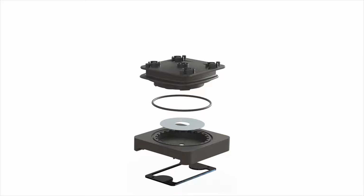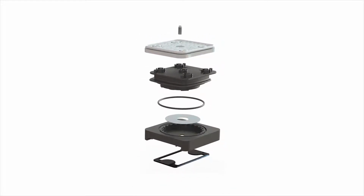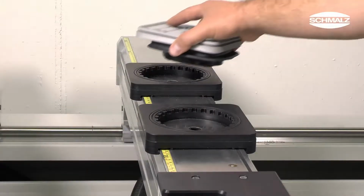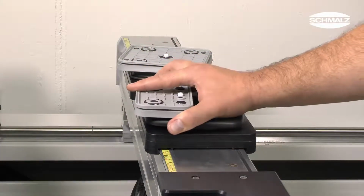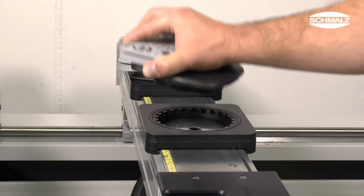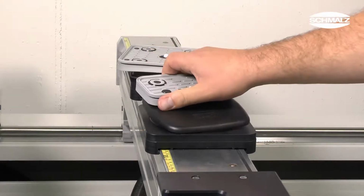With the APS4, you are now able to use the standard VCBL-B vacuum blocks, making your clamping system a lot more flexible and cost-efficient at the same time. With the combination of APS4 and VCBL-B, you can rotate the vacuum block in 15-degree increments, thus making it possible to align the suction plate parallel to the console or even replicate odd shapes of your workpiece.